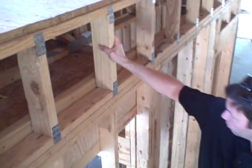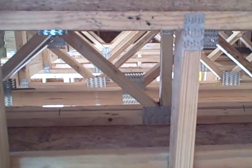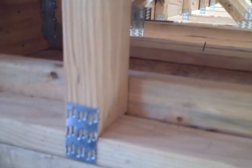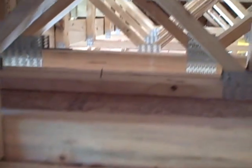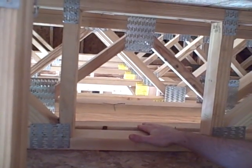This is an engineered truss floor system. You can see it's made out of 2x4s and they put these metal gusset plates on there. It's just like the truss that you'd see on a bridge. These are incredibly strong, super flat — dead flat. And as you can see as the camera is scrolling down through there, they give great open access for mechanical systems.